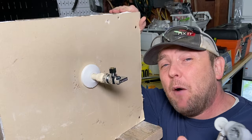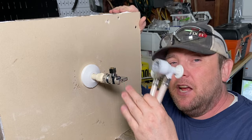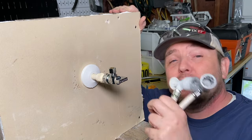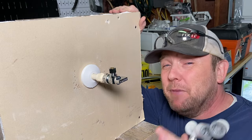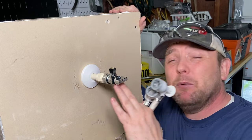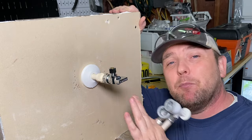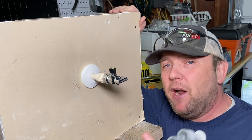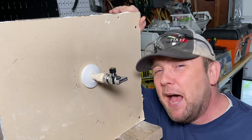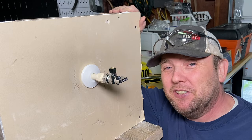So this is how I get rid of this style of valve on CPVC. You're going to see a lot of videos out there that tell you just pull it and spin it counterclockwise and it's going to come out. I'm going to tell you that if you do that with CPVC, there's a big potential that you're going to break it. It starts to get brittle after about 10 years — it can end up being a train wreck and a downward spiral. I've had it happen too many times and I don't want to see you get in that situation.